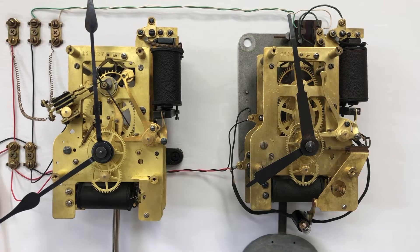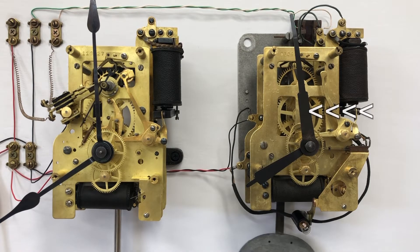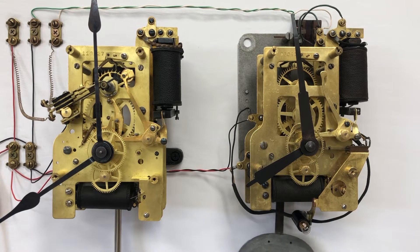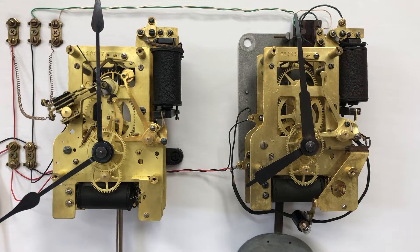The synchronization involves mechanically moving the hands precisely to the hour. It may be needed if the subsidiary clock is slightly fast or slow. If the subsidiary clock is accurate, the hands will not move. For demonstration purposes, I have the subsidiary clock running one minute slow. Later you will see the master clock synchronize — that is, the subsidiary clock will show the exact master clock time.